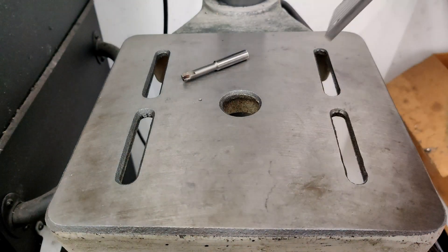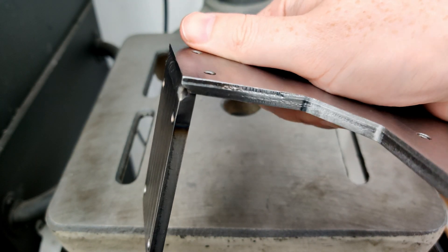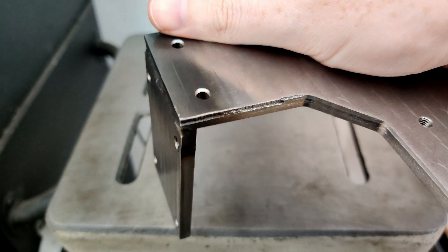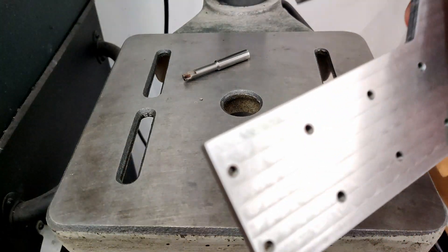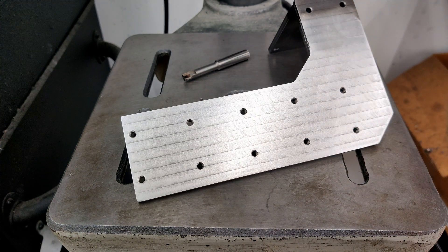When I first started out I tried 0.5 millimeter step down, and that was obviously too much. As soon as it started cutting on the Y axis at full depth, it started producing a lot of oscillations and vibrations, and that was enough to get a servo to freak out — I think it was the X servo.